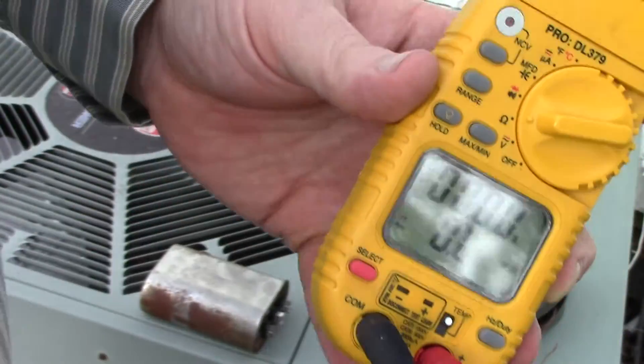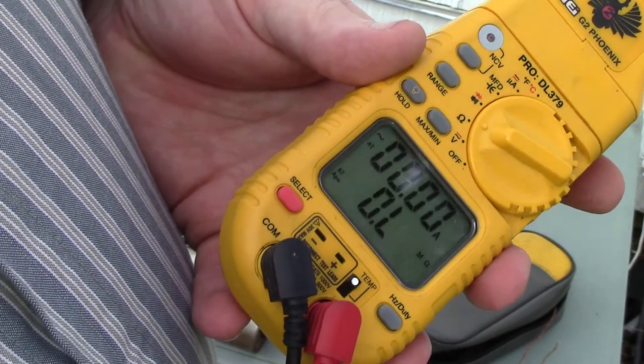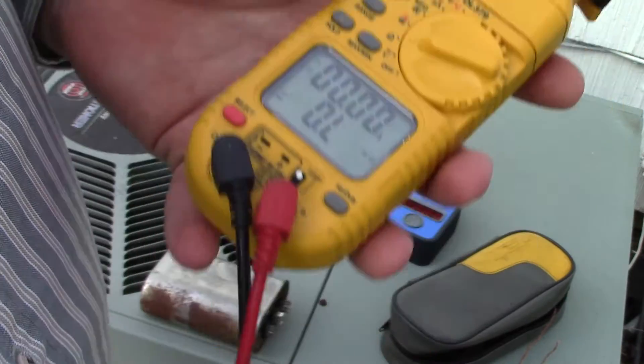We got OL, but in this case it's also open since the capacitor is bad. If it were shorted internally, you'd see some type of ohms reading. That's a quick and basic way to test your capacitors using these two tools — hope you guys enjoyed it.